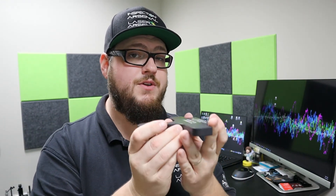Another problem you can run into is probe crashes, and programming around a fixed qual sphere can be pretty tricky. The qual plate allows you to mount your qual sphere to this plate, mount it to the lock-and-load system on your granite surface, qualify all your probes, get the machine ready to go, and then remove it completely off the granite surface — eliminating any probe crashes and making everybody's life a heck of a lot easier.